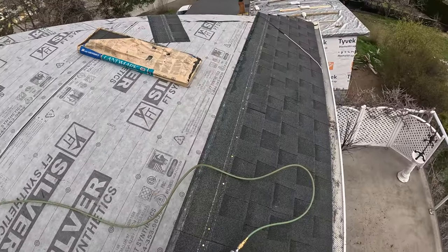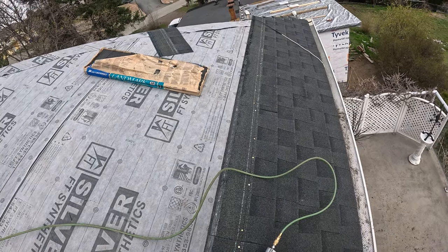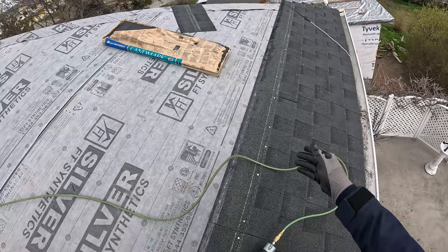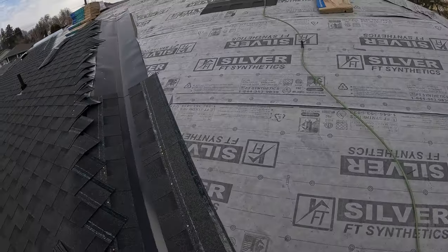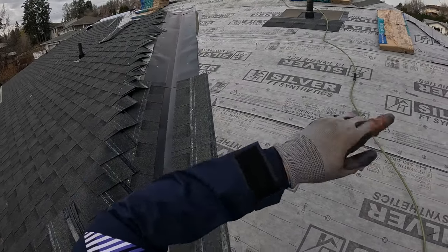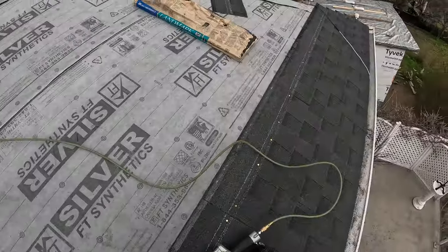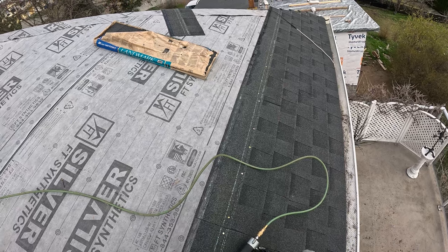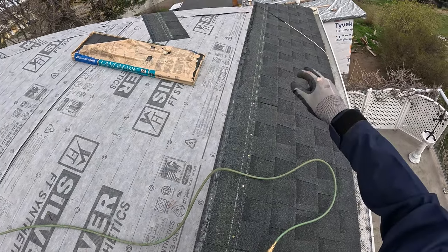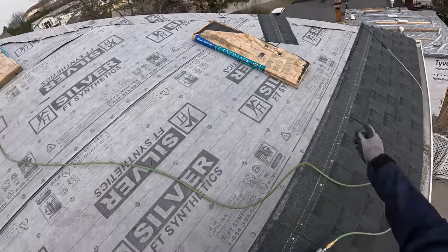Better here to go, you know, four or five rows up to see how straight these eaves are. That way you can make a correction on your fourth run and square this up, so as you're going up it remains square to that hip. Over this we're gonna obviously have to snap a line across to get that matching the other side, maybe a drop row, but that's the whole purpose of this. A lot of times at the corner of a hip, these eaves will hook way out. I'd rather just run four rows across, even if it's a whole length.